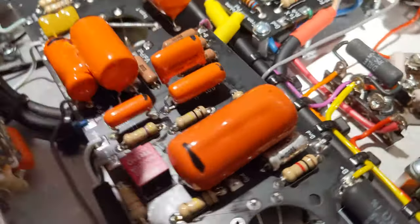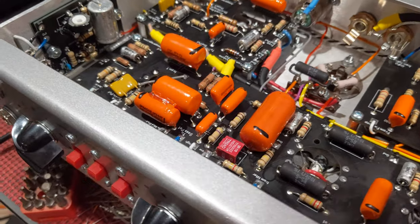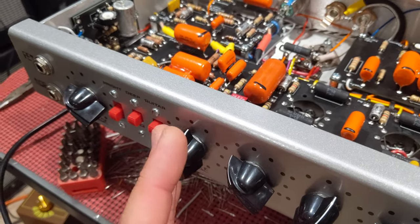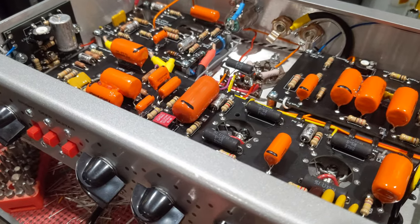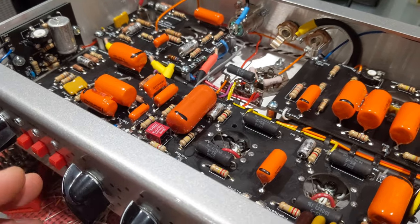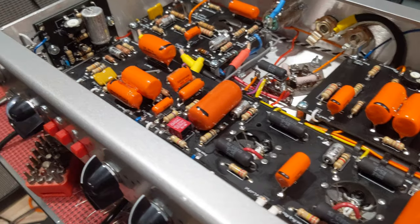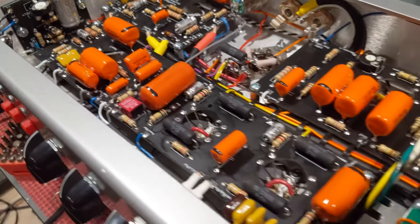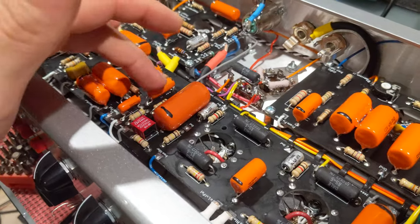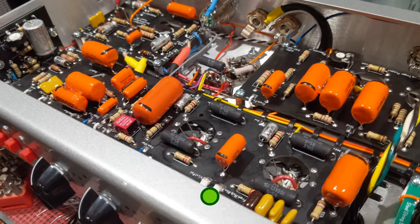For a quick temporary test, you can see that I soldered these legs in place. I plugged it in and wow — there's a lot more bottom end. This amp feels pretty well-rounded now versus the original bright intention. For John Mayer friends out there: if the circuit is the same as John's, you'll notice he had to come up with a JM SIG to fill in that bottom tone. These two changes bring me pretty close to a very well-rounded amp. In studying 2-Rock style steel string singers, they use 0.02 as well — tone achievement unlocked.